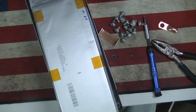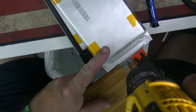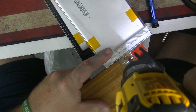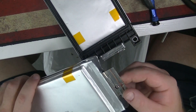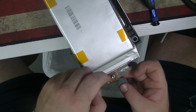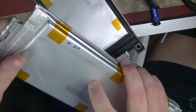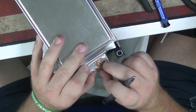Just punch right through it — there's our first hole. Next we're going to drill through. The safest way to do this is to have some type of backing. The right-size hole punch would be amazing but I couldn't find it — if you can find it, let me know. Once that's done and everything checks out, we can get our bolt through there with the nut and bus bar. That's going to be the idea — make sure these aren't touching, then we can mark out where the hole is going to be for the other tab.